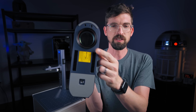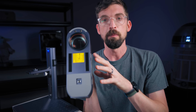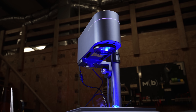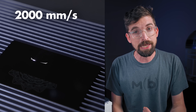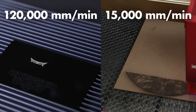Looking at the lens, you can see a mirror in the middle which is part of the galvo mechanism — a galvanometer. Unlike gantry lasers, the light beam is generated here and reflected by that mirror all around the workpiece, which makes these machines extremely fast. At the bottom, the two red focus dots come out. On speed, this runs at 2,000 millimeters per second, compared to a diode gantry machine that tops out at around 15,000 millimeters per minute — that's 120,000 millimeters per minute versus the gantry, because the galvanometer moves like a fish tail rather than traversing the entire work area.